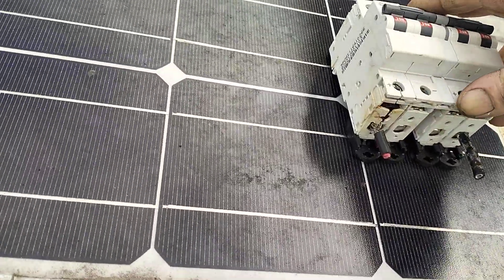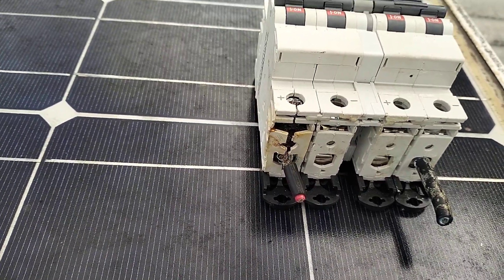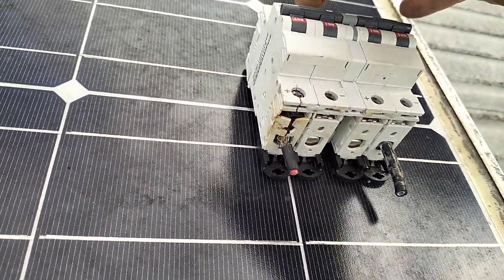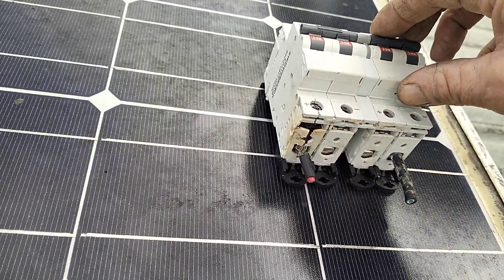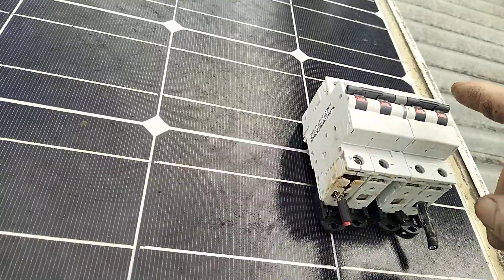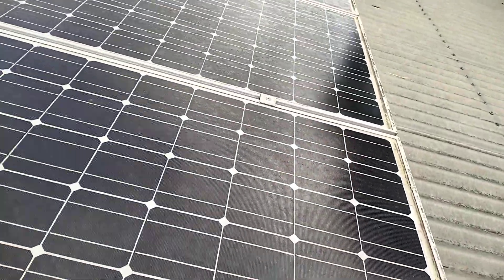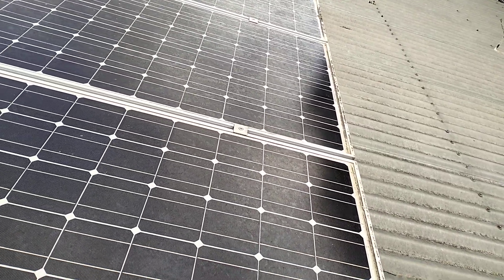Here's the isolator, and as you can see the left-hand pole has been damaged by electrolysis. You can see a bit of mud and water staining on this conductor — that was the negative, and that's the positive coming in. They were looped at the top, so you've got two poles in series on each leg. It's a four-pole General Electric, very high quality isolator with auxiliary contacts — about $200-something dollars — but completely ruined. Water ingress cuts the life very short.